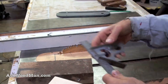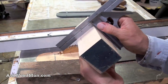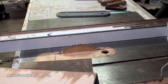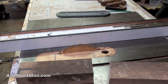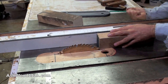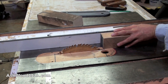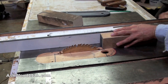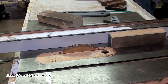Now this is enough squareness to cut true on the table saw. I didn't even have to get rid of all that because it's all going to get turned away anyway. I'm trying to leave maximum dimension to make sure I have enough material to fit into my two and a sixteenth inch diameter pipe. I'm still at over two and a quarter, which is good - I'll just whisper this last cut and that's going to be good right there.